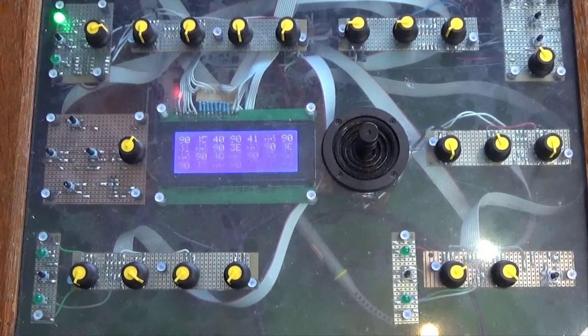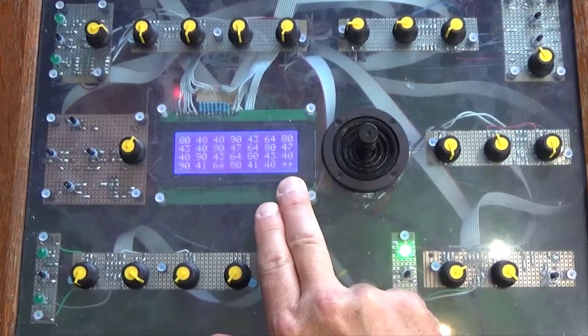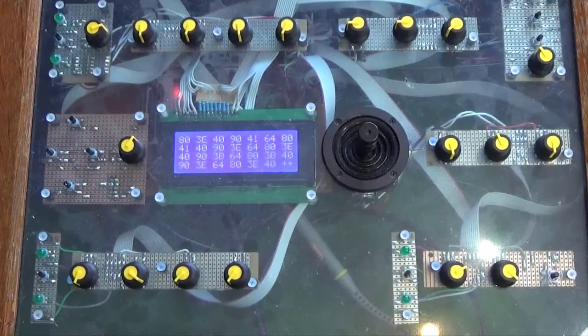So every time it's updating the screen, it's just reading what's in the buffer, and it's firing quite a lot of notes. And the plus plus here just means there's more than will fit on the screen. So if I slow the tempo down, it's putting the MIDI out slower, so we're getting less on the screen. So that I think we'll do for now. I think we'll call the MIDI input working, and we'll check it more carefully when we actually get to reading MIDI messages.